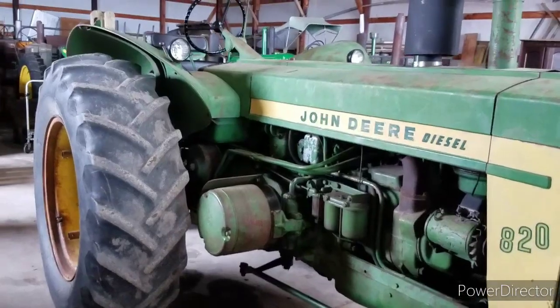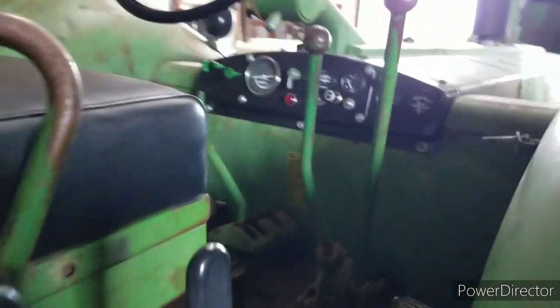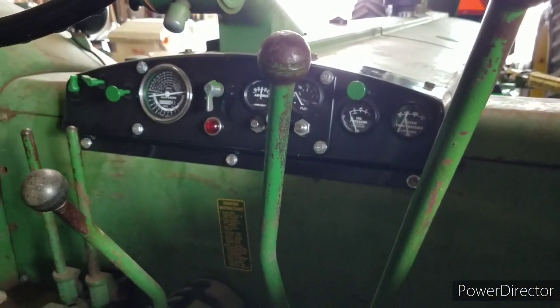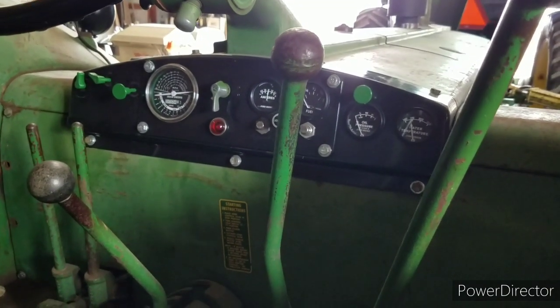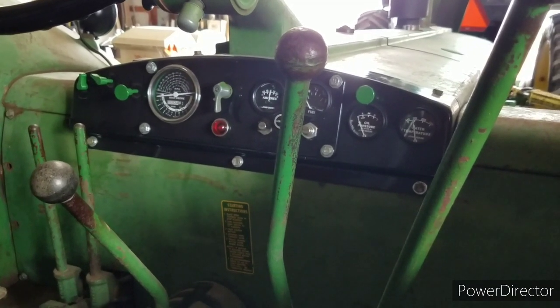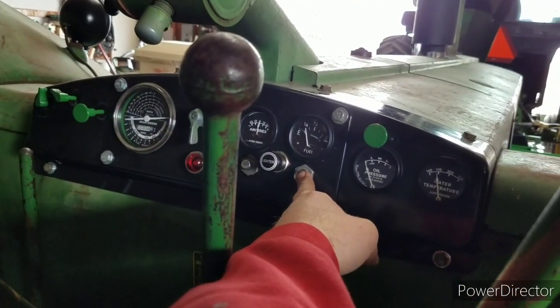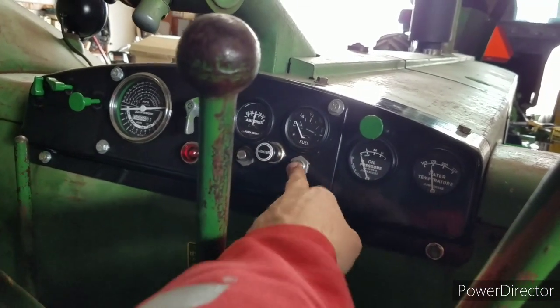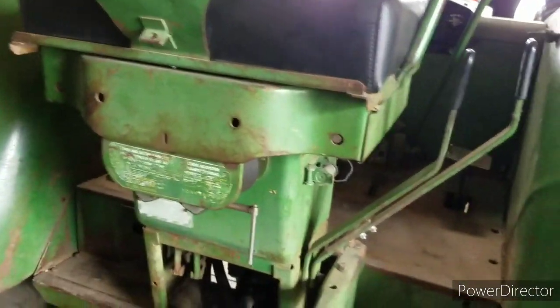And like I say, I put new headlights on it. Switched it over to the oval exhaust, new steering wheel, new seat cushions, all new gauges, and I put in a new tach. The red jewel lighter replaced that, new starter button, new cigarette lighter, new fuel gauge. On these tractors, the only way to check the fuel is you push the button, it charges it, and then it energizes the system. And I rebuilt the float ride seat on it.